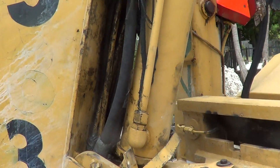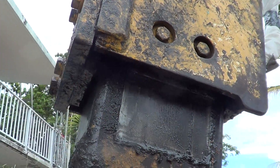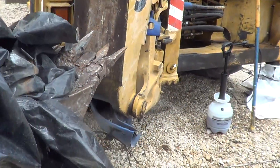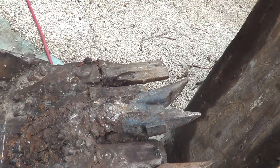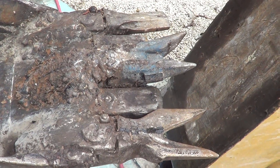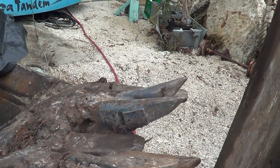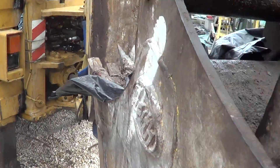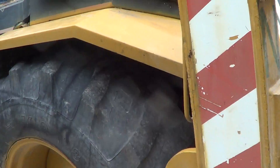The machine is 100 percent greased. I replaced the slide on the extender hoe about a year ago. On this bucket, I replaced a missing tooth with a much more heavy-duty tooth — I call it my scratch tooth. If I want to cut asphalt, it is set above the rest so I can scratch concrete, rip out a tree root, or scratch asphalt to make a cutting surface and then fold it over.